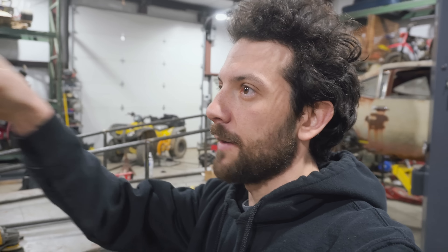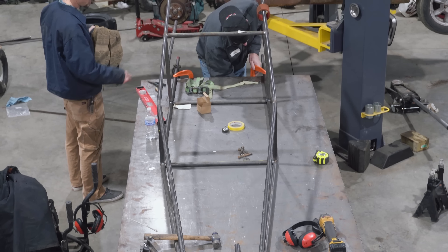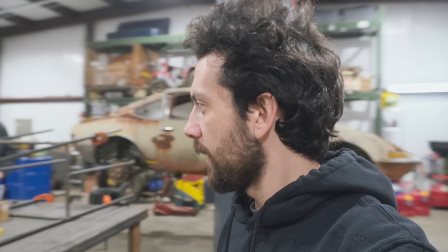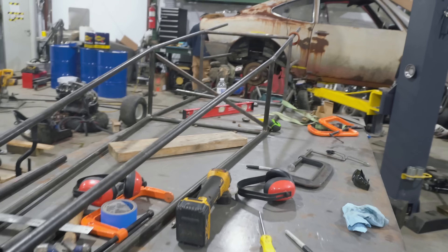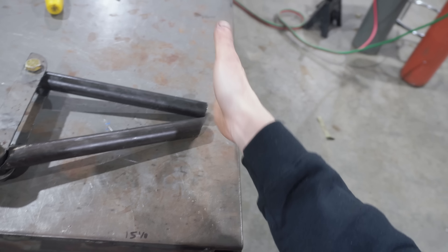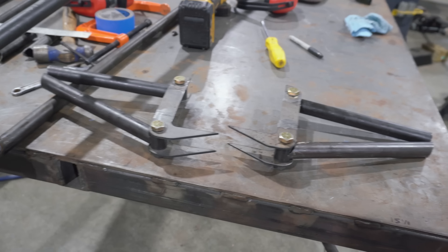So we straightened our frame last night. We got in this morning and I noticed we still have quite an issue, so we need to fix the top side of the frame now. Charles is going to work on tacking our front suspension in. We think it's because we built this chassis on wood blocks — usually we go straight to the floor, and the floor is usually straighter than the wood blocks we used. But we'll fix it. So I have our front suspension mocked up. We're going to skip out on the height adjustability, especially because there's going to be practically zero weight on the front of this vehicle — it's not going to want to sink into the sand like the rear. The hub and spindle is going to get welded on with our desired alignment. I'm going to take these apart, weld these tubes on our other tubes, and get them reinstalled.